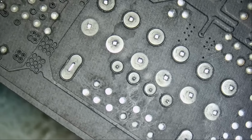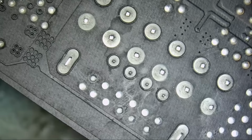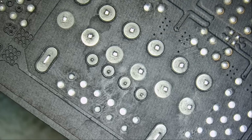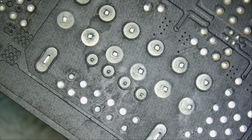Let's start with card one. Now, to remove the connector, what we need to do is apply low melt solder so we can mix low melt with unleaded. That will lower the melting temperature of the joints so we can easily remove the connector. I mentioned this many times before, since video number one, since the video that we did in January 2023. We use low melt solder, so we do not have to apply a lot of heat onto the board. It doesn't matter how much heat you apply onto the board, it's gonna take a long time before you are able to remove that connector.